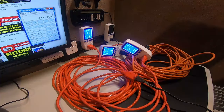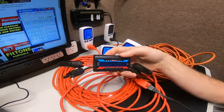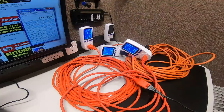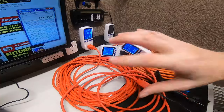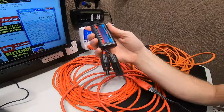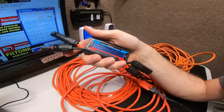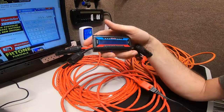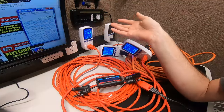These little meters here — use these. They'll tell you what kind of voltage drop you're having. If you're going to run a long cable, at least get a higher gauge — meaning a fatter cable, which is actually a lower number. So if you have 20 gauge, you'd want 10, 8, or 12 — lower in number means fatter cable. Check voltage at the beginning of your solar panel run, then go to the end and see what you're getting before you make a permanent install.